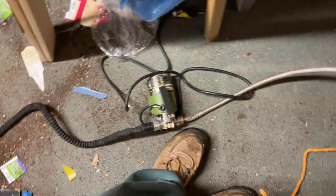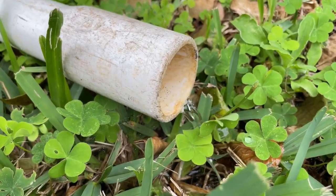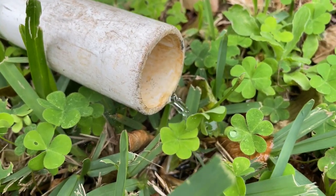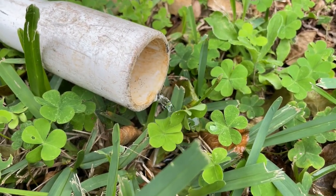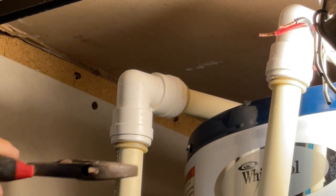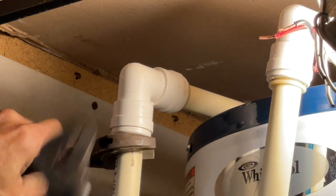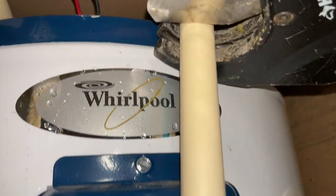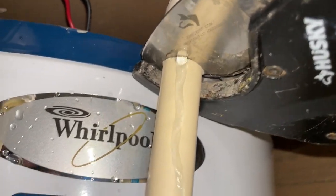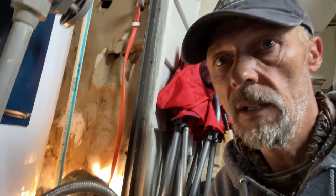Let's get our pump plugged in — man, this is going to be a slow drain. There's so much sediment up inside that tank that even with the pump on, that's how much we're getting out of here. Everything about this water heater spells wrong and this thing will not drain. I've tried the pump, I've tried every trick I have. It's a 30-gallon medium.